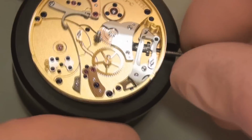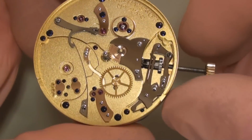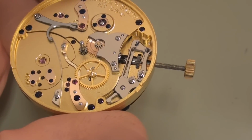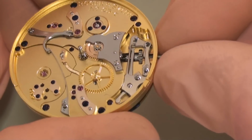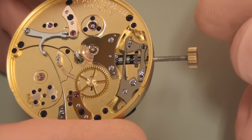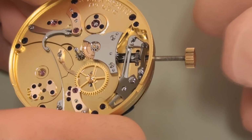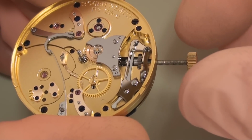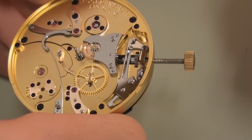Another feature of the watches, as a watchmaker you do look and study other types of work, and one thing that I've noticed is the click. When you're pulling the stem out into handset, what you really want is a very nice sharp click, and likewise when you push it in, again a very brisk, very snappy click. And also the actual tension as you push in the crown, you've got to feel this snappiness.